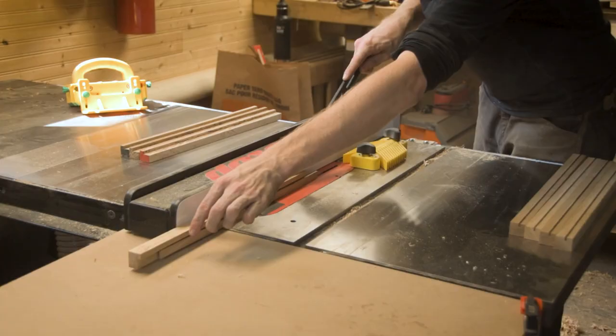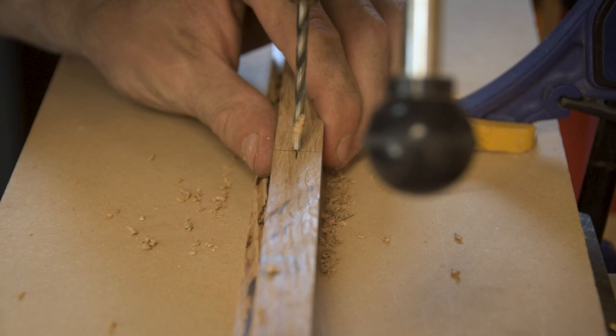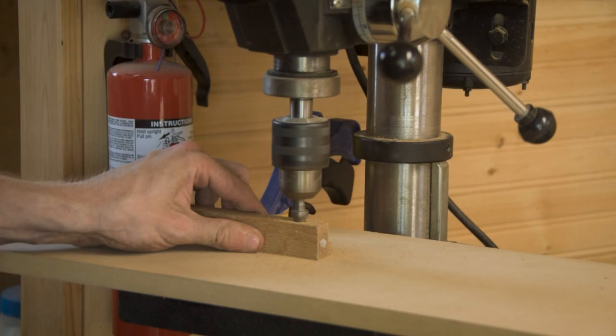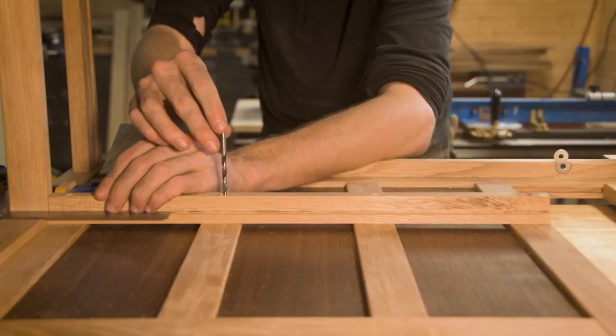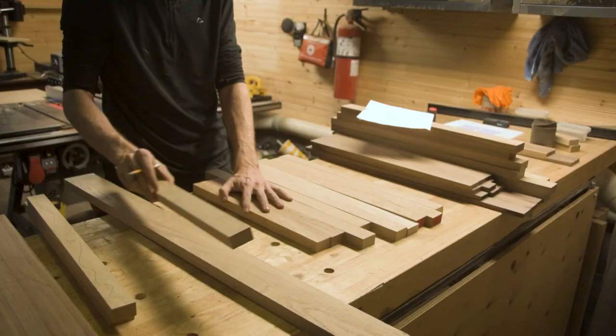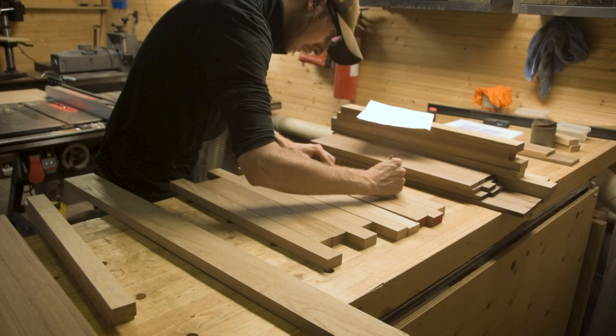And again, super simple. For the drawers, I didn't want to use any kind of mechanical drawer slide. These wooden slides are going to be a lot easier to install, but also a little more future-proof because they can't really wear out, whereas ball bearing drawer slides do have the ability to wear out. From there, I could start working on the back panels.